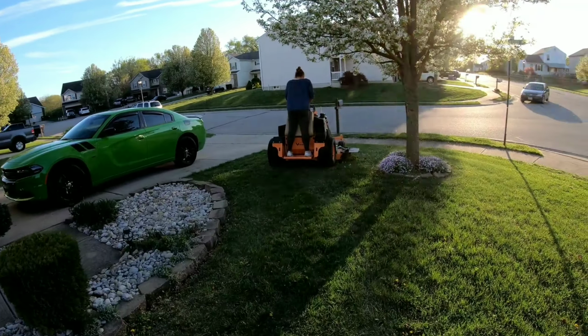Okay, that's pretty nifty. So what do you think between the Scag and the Bobcat? The Scag does cut a lot better. It's smoother. It's not as jerky. Yeah, but I like the Bobcat because it's smaller. This is just too big. And I feel like I'm going to knock down rocks, or I'm going to knock down a fence. The biggest thing that I can recommend is that you just watch whenever you have a bump or a dip. It'll lean this way and it'll scalp. That's the main thing. You don't have to worry about that with smaller ones.